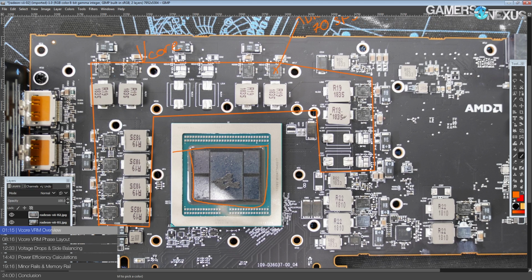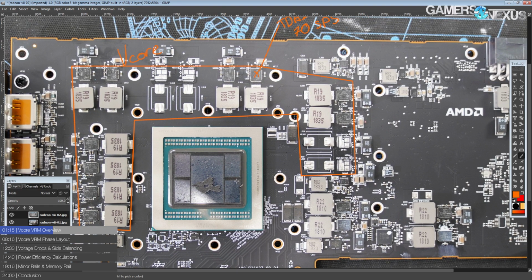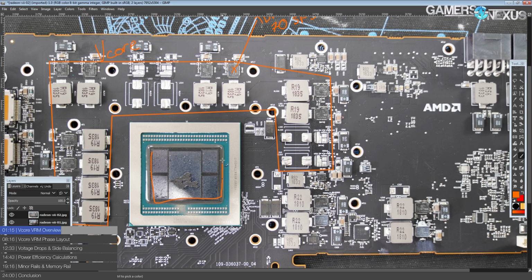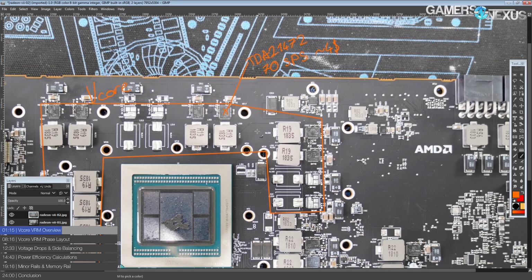And this isn't going to get cheaper. That has a relatively fixed manufacturing cost, and I'm not even sure if it's possible to manufacture HBM GPUs without all of the HBM populated. If you look at the Titan V, it only has 3 active HBM stacks, but there are 4 of them on the chip. So I'm wondering if AMD even has a choice about going for less HBM with this thing, because it might cost more to assemble than it costs to buy the actual stacks. The issue is that you can only assemble it as a 4-stack configuration, not as a 3 or a 2.